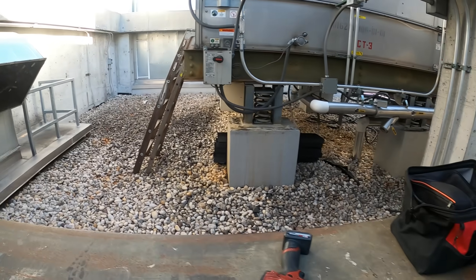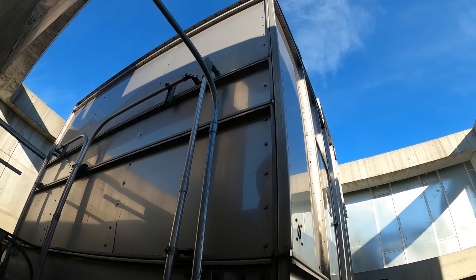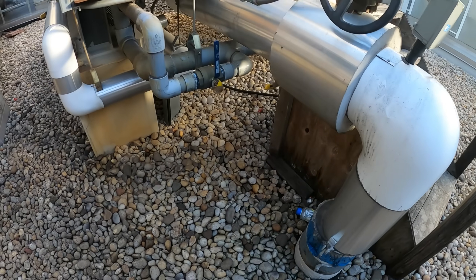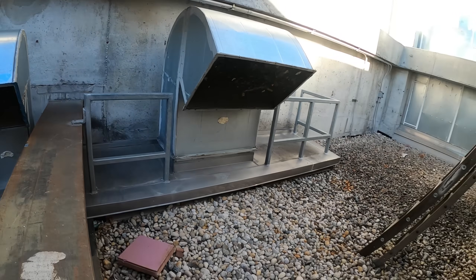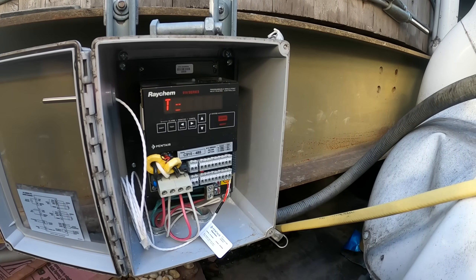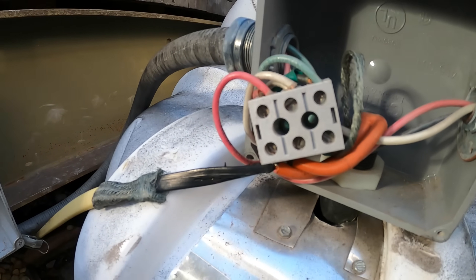I followed that line and it goes to the heat tracing setup for the cooling tower — they're sharing power from the same source. Something is wrong and I called tech support about the GFI trip on the second controller — some kind of ground or power issue — which makes sense given the wrong voltage. Surprisingly the first one is still doing its job, but without the right voltage it can never work correctly. We need to either restore the voltage or replace the heat trace cable with 120-volt-rated cable and rewire everything properly. This whole setup is a mess.